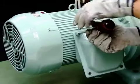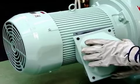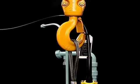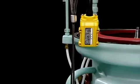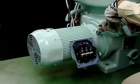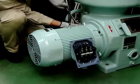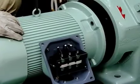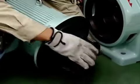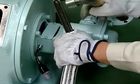If the electrical connections are incorrect when you perform assembly, the motor may run in reverse. Be sure to make a note of the correct connection numbers. Set the chain block on the motor and remove the four bolts to remove the motor. Next, remove the connecting tubes from the gear pump.